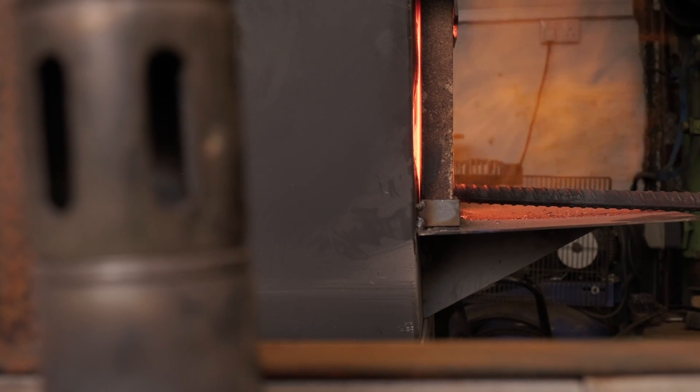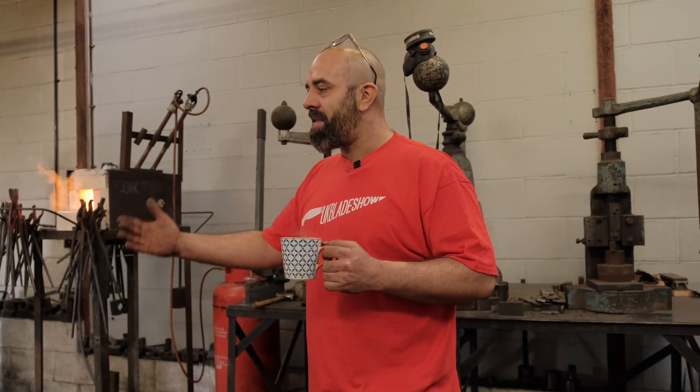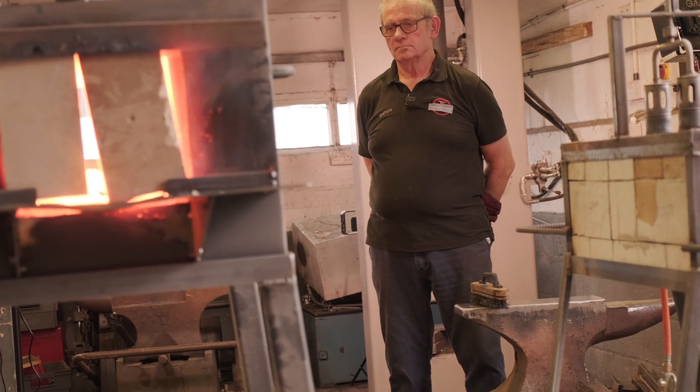When you do that press, if you see any oxide coming off the outside of that stack you haven't got the right atmosphere in your forge — shut down your air a bit more, turn the gas pressure up a bit more, whatever it takes, but make sure you've got gas-rich with nice dragon's breath coming out at each end of your forge. Now wait until it starts to get really hot, going up to red and into the orange. You're using a lot of gas — don't leave it forever, but look at your stack. If it looks orange on the outside but dull red in the middle, it ain't hot enough. It takes time for heat to travel through a big stack; leave it another five to ten minutes until it's an even color. Make sure your forge is nice and hot before you start — I preheat my forge for 10-15 minutes.